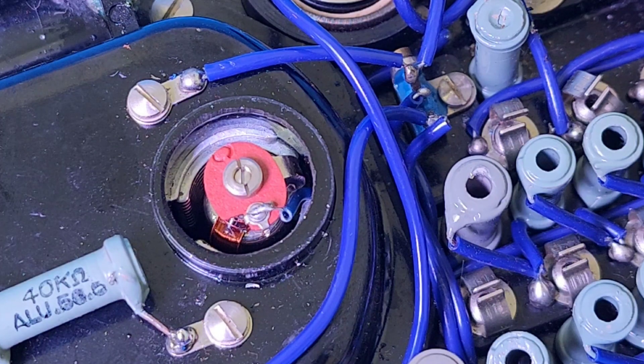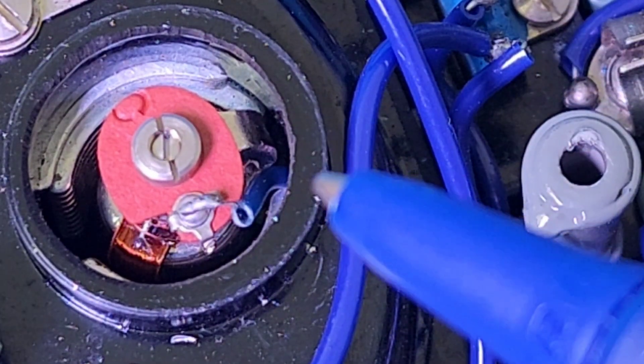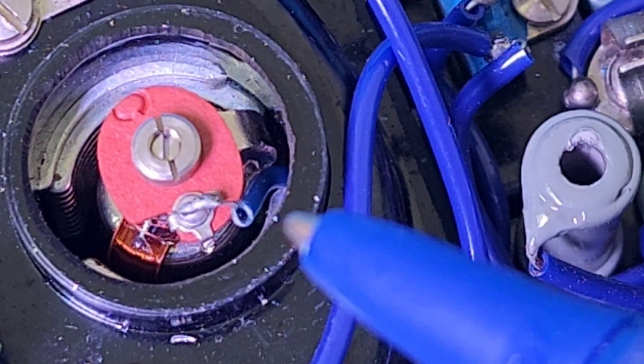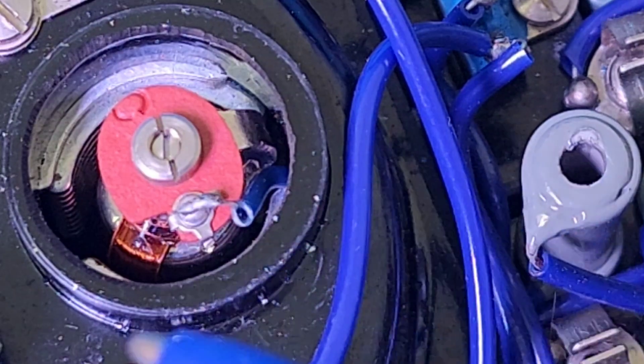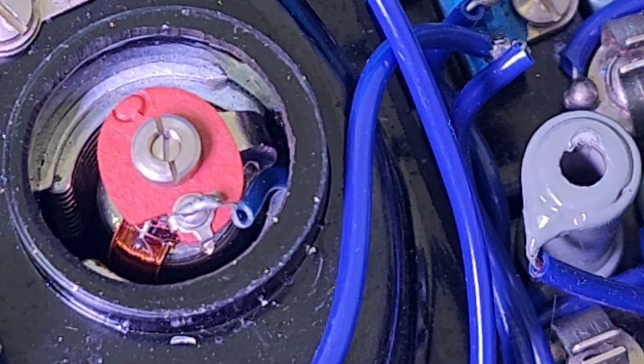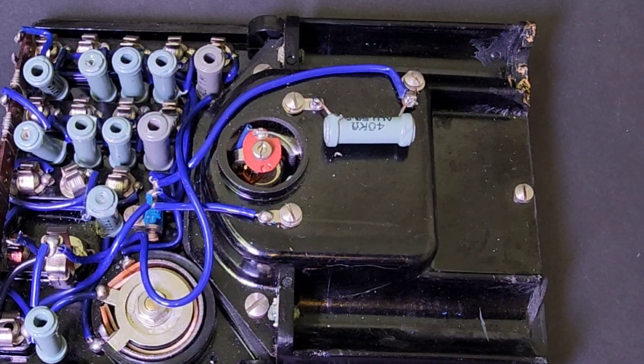The driving force of any analog meter is the current that passes through it. Besides the coil itself, we have the counterbalance, a cylinder support, and a lower control spring. The fact that such precision movement exists can actually create problems — one of the biggest is foreign matter. Magnetic particles, for instance, can stop or impede the movement of the coil in that magnetic field.